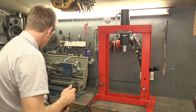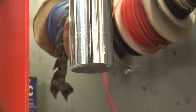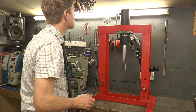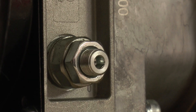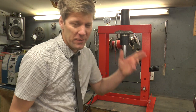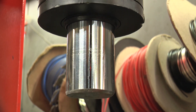I don't know which direction is up or down on this yet. That's back. Here we go - is it going to have a stiff spot near the weld? Who knows! Here we are, what are we rocking? That was about 160 bar. Now, there is a little adjustment on the motor - basically when it hits its end stop it goes into a bypass mode and chucks all the oil back into the tank. I can adjust that so it does it at higher pressure, but I think I can live with 160 bar at the moment. That's a lot faster than pumping it by hand.